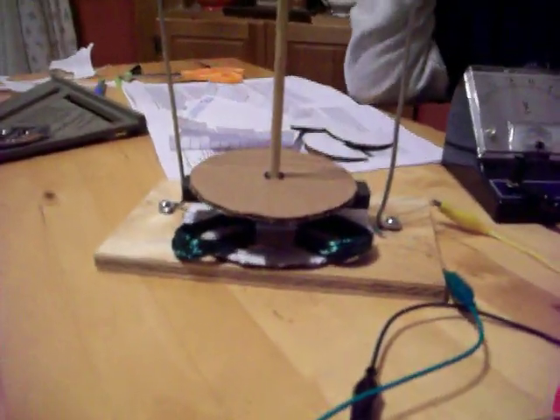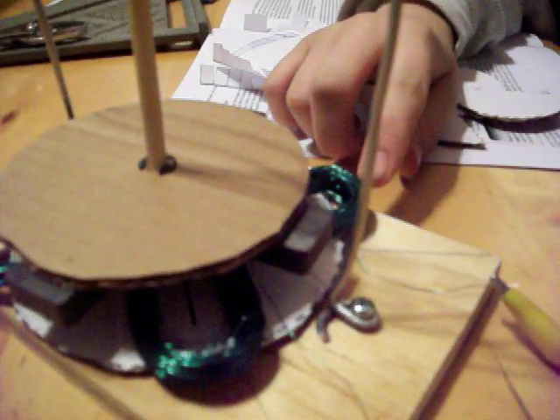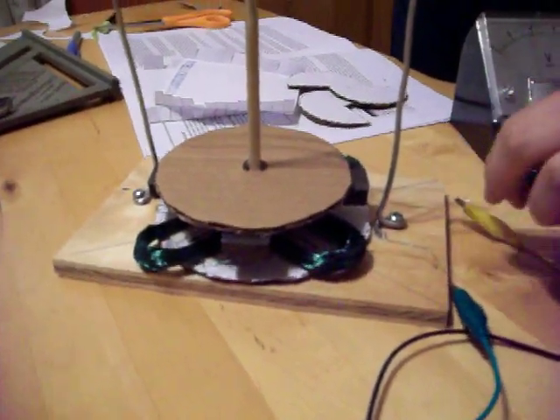What are the parts of the generator? Well, as you can see, there are magnets here. They're called ceramic magnets for their density or other principles of some sort. These are copper wire insulated with green enamel, and they are linked together in alternating counterclockwise and clockwise formations until they come out to these two leads.